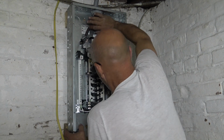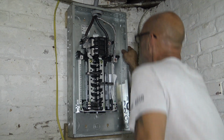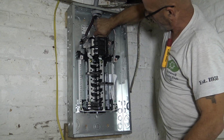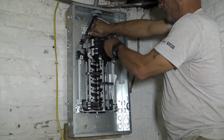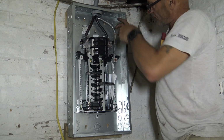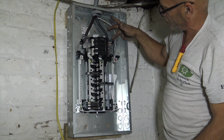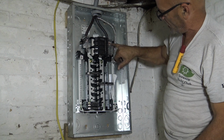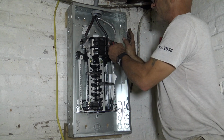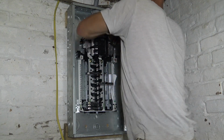Let's get that neutral, push it back out of the way. We don't want that interfering. And I feel a lot better putting my hand on it now. Okay, this wire is going all the way through, so I can tighten this one up. I see, because this covering that's around it is clear, so I can see that I have the strip portion of the wire up on top of this lug, and I can see that it's on the bottom. Yeah, so it's past it. So it looks just like this one, but it's just harder to see there. I'm going to tighten that up.